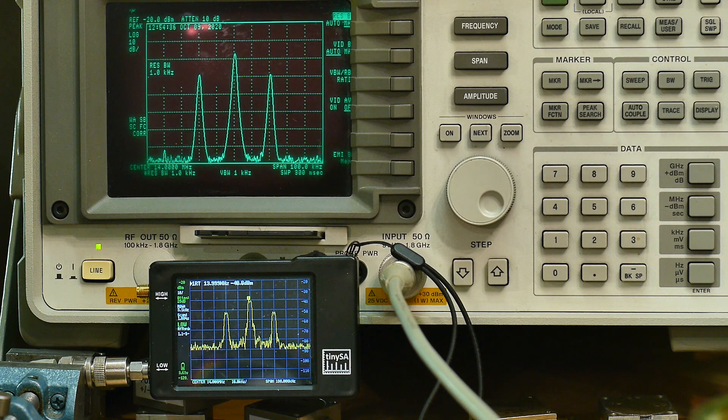So I found something interesting. It's particular to the TinySA and it's particular to the TinySA's bandpass filters. They are digital bandpass filters, and I believe they're digital and they're inside the SI chip, so I don't really know how they're constructed. I do know that their shape is strange compared to regular LC circuits or crystal filters and things like that.